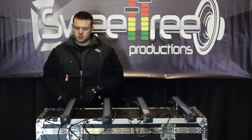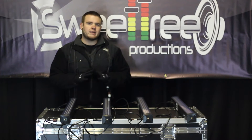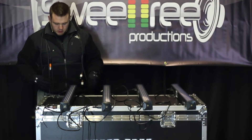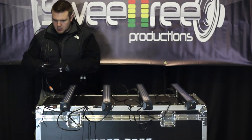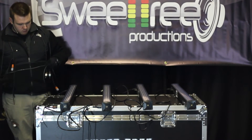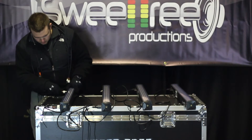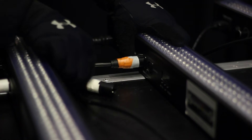First things first, we've got all four of them and we've got power. The way daisy chaining works, we have one master — which is this one right here — and then these are going to be our slaves. We're going to go ahead and use DMX cables, which I have wrapped around me right here. We're going to go from the DMX out on the first fixture to the DMX in on the second, and just continue down the row, daisy chaining them all together.